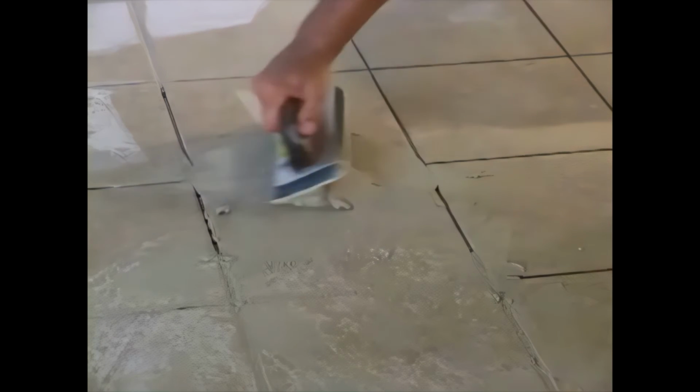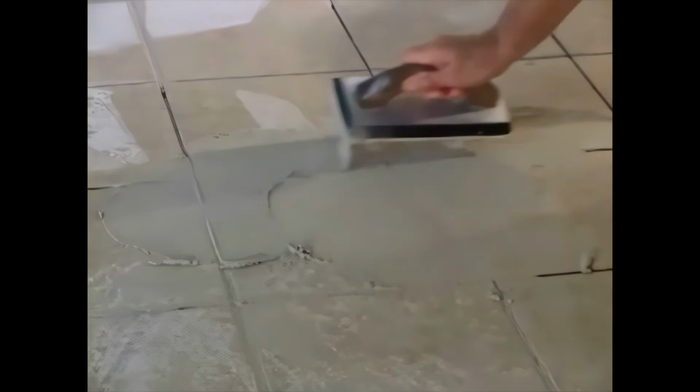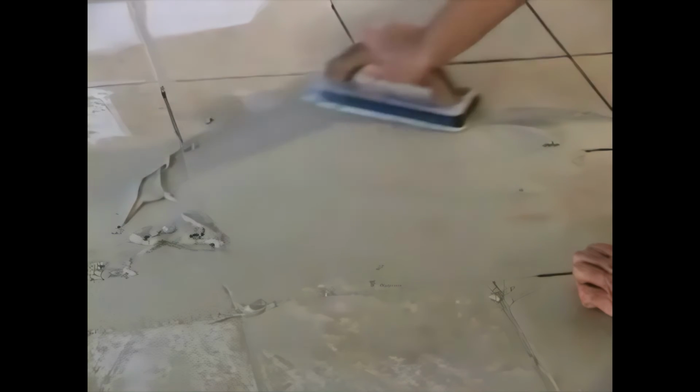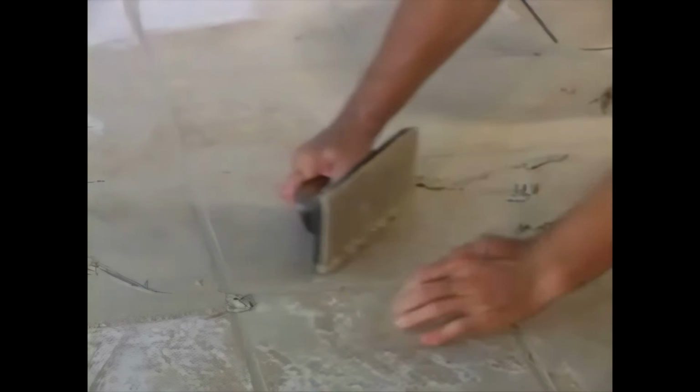As you progress, the grout in your pail will begin to dry. This is not desirable, so add a little water and give it a good mix every 20 minutes or so to keep it fresh. You'll pick up speed as the job progresses. Try different methods and experiment with slightly thinner or thicker grout mixes.